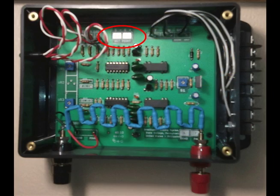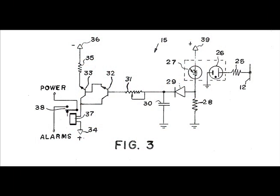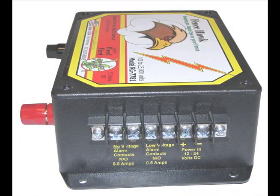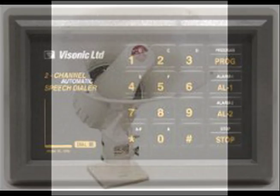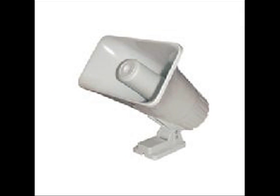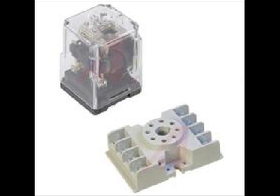That's the basics of the Fence Hawk. As you can see, there's a lot more to it than that 1978 patent based on a flashing neon tube — we actually physically measure the voltage on the fence and make a lot of logical decisions. The terminals on the end of the box can hook up to any standard alarm panel, or you can hook them up to sirens, flashing lights, or strobe lights. Thanks for watching today. In our next episode, we're going to visit the Fence Hawk factory.